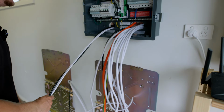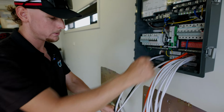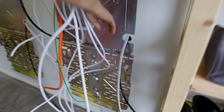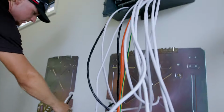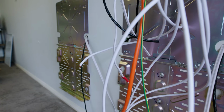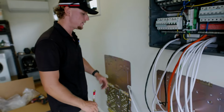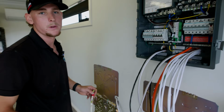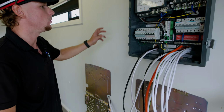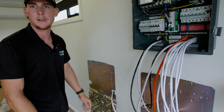These 6mm and data cables, we could also utilise this brick veneer, drop it straight down, going behind timber studs and noggins, pull it through here, and then the same thing down and across through here, which basically the perks to having this brick veneer wall essentially in the cavity is we don't have to use conduit, which can look messy in some people's, in everyone's houses. No one wants conduit work along their wall, so this way it's nice and neat, hidden, and just a better outcome.